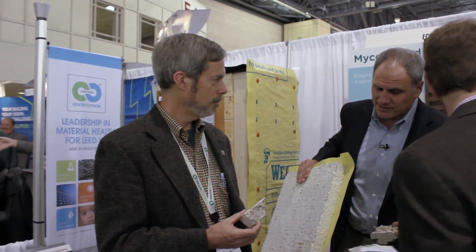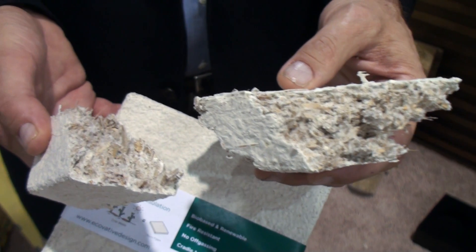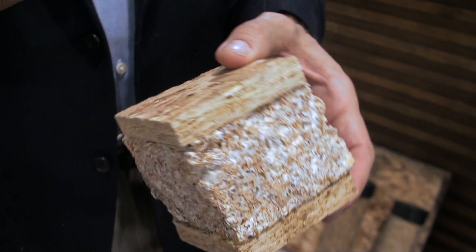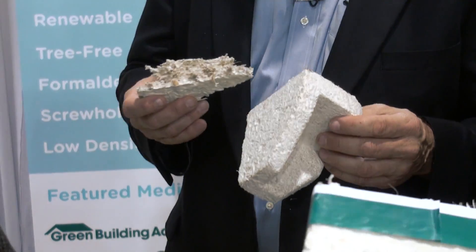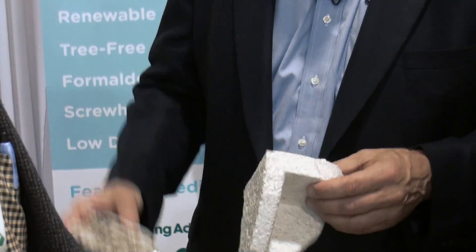Not in a sandwich. They're working on SIPs — that's a sandwich. They're working on foam-in-place, so this one is really cool. We were just talking about this. They put the corn husk mushroom spore mixture in the wall cavity; it grows for about a week. Inoculate it. Mycelium, which are basically the roots of the mushroom, fill it up and create this foam, and then they dry it out and it cures and hardens and provides some rigidity. It's already used in packaging — it's licensed out. They're shipping stuff in it, so we know this stuff actually works.